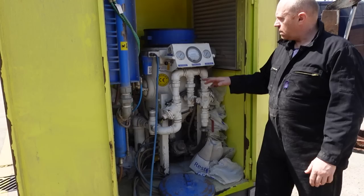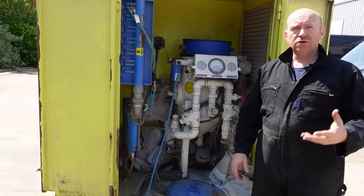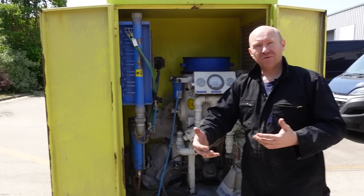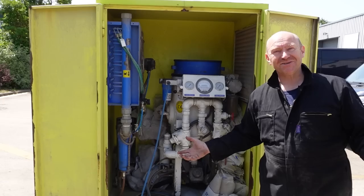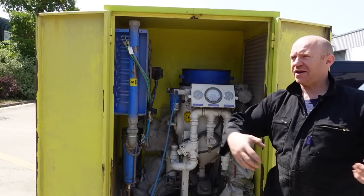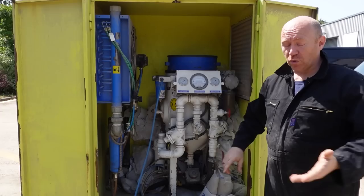With the glasses and fines you'll actually take metal off. So for catering equipment in the kitchen you use soda - bicarbonate soda - because soda will not take any metal off in any way, shape or form, and will not touch rust. It's safe to water down because bicarbonate soda is actually a food. So you can use that on catering equipment in situ - it's quite spectacular, like someone's got a big bag of flour and waving it around everywhere.